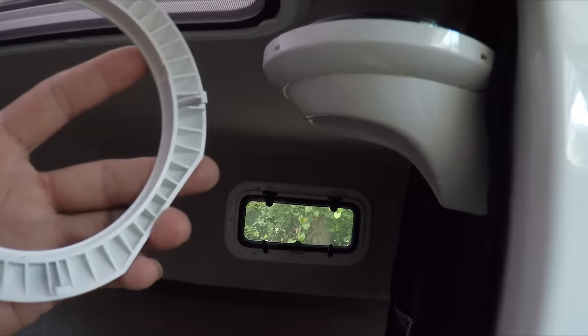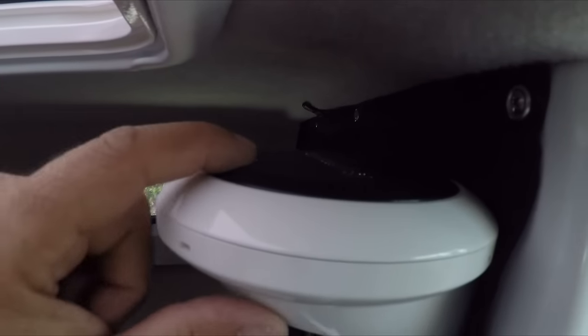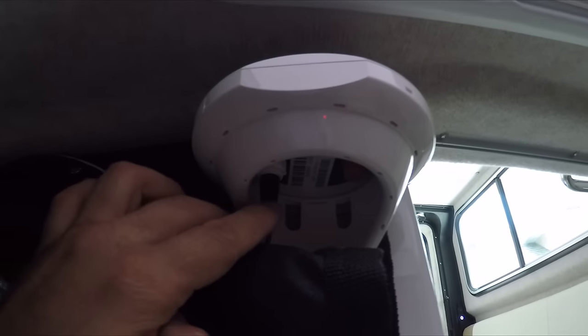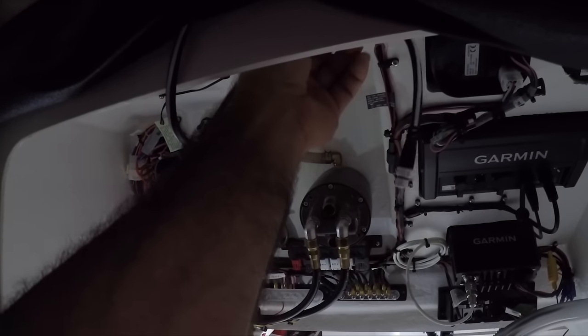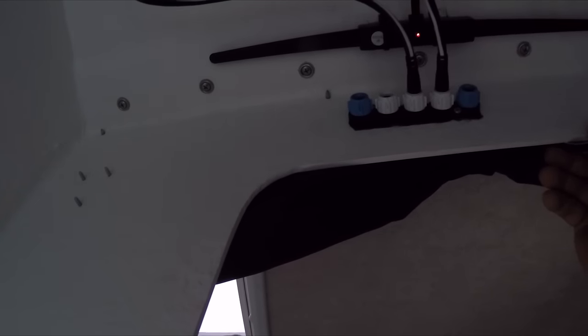Now what I'm going to do is put the clip back on. Now that it's in place all I have to do is pull to the left — there it is, it's locked. The EV sensor is already in place. It's not going to fall off; it's pointing forward, well positioned away from my electronics. Now I'm going to install the SeaTalk connection here. That wire is locked into place and secured. Make sure you don't bend this wire too much — it's very important not to bend it. That's already locked into place, so I've got two of the wires in.